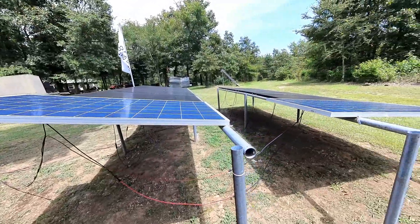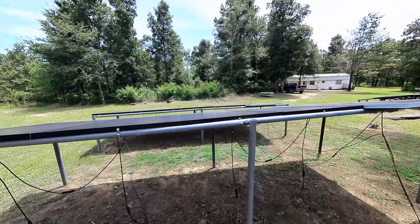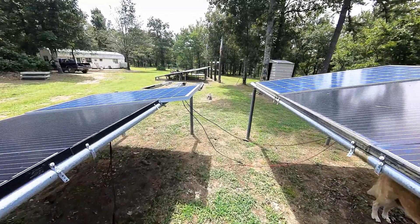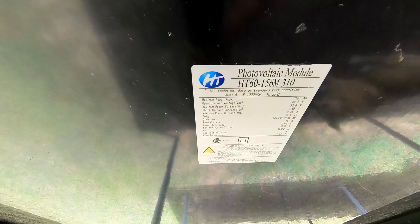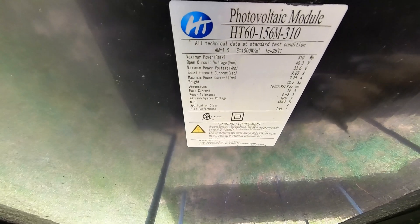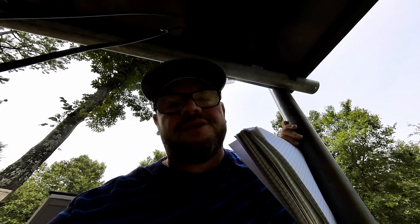When you buy solar panels you're looking for, in this case, 24-volt solar panels. Most panels these days are going to be 24-volt. You can tell by looking at the sticker on the back of the panels — specifically the open circuit voltage, or VOC. Let's go underneath the panels and look at that sticker. On these panels the VOC is about 40.3 volts, meaning if the panel is in direct sun with a multimeter on positive and negative and you're not pulling any amps, it will show 40.3 volts.